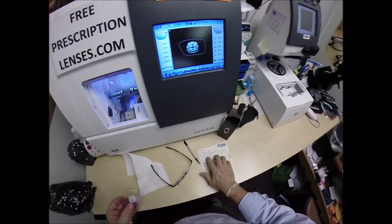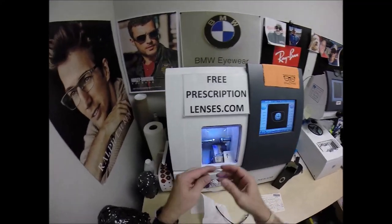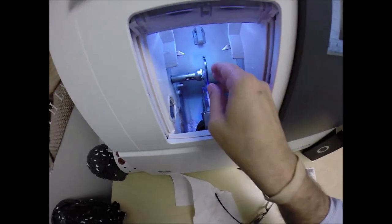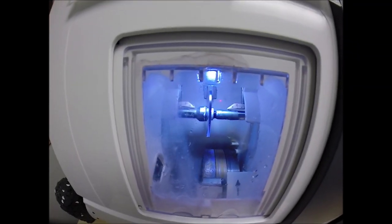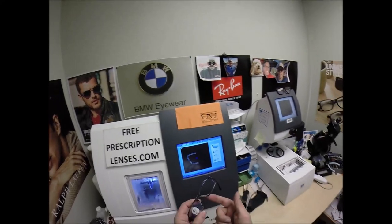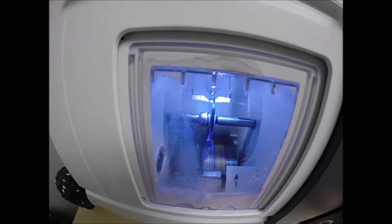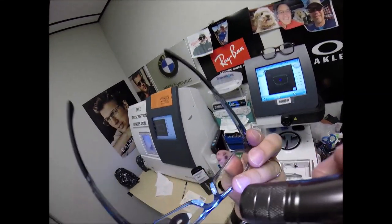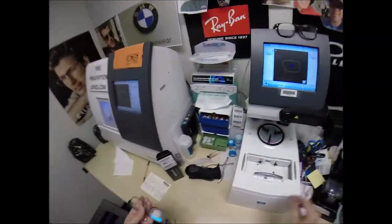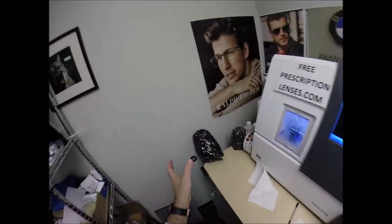Flip this over to L. This lens is a little bit stronger, so I'm going to take it down one-twentieth — we're at 0.015 over here. Turn it right side up, place the magnet into the chuck — the Charles, the Chucky baby. But tonight I'm calling it the Rocky. Hit the start button, the door closes, the clamp shuts. The lens is going to be traced again by the two white styluses, making sure it's large enough to fit into the frame. You can see as it's going around tracing the shape of the left lens. It's measuring the thickness to know where to place the bevel so you have the best cosmetic look possible. Rocky, look at that — you've got no edge thickness there.